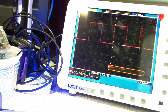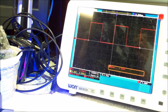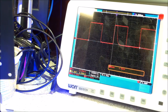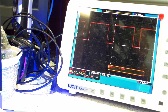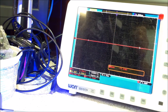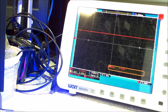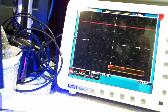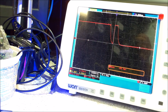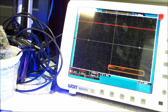Let me adjust my trigger level here — you can see there's 50 percent, and that's about 50 percent duty cycle. We'll go up to 75 and then all the way up to 100. You can see 100 is full DC, showing at the bottom three volts. It's actually showing 3.06 volts as the mean voltage.